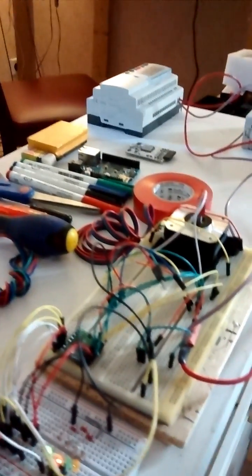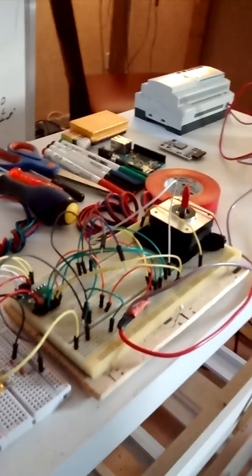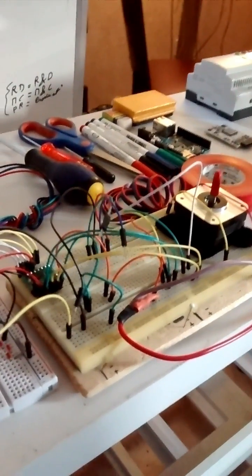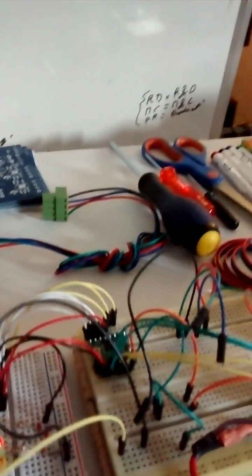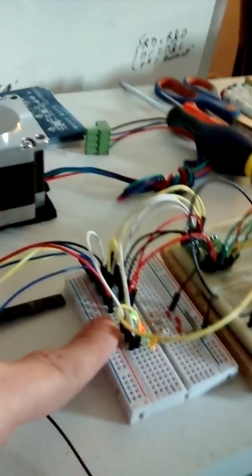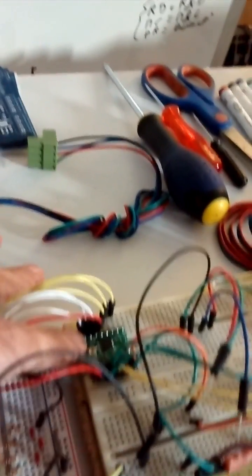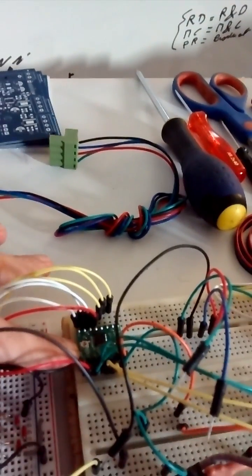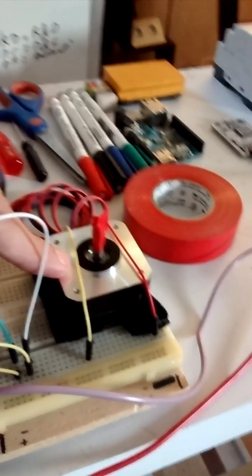Good morning. To run this motor at 6000 rpm, what we need is nothing less than a 150 kHz signal to the driver, which is this small tiny board over here. To make this work I use this RISC-V board. That's our interconnect. That's an A4988 driver board set up for 1.7A. That's a 5 dollar stepper motor from China.